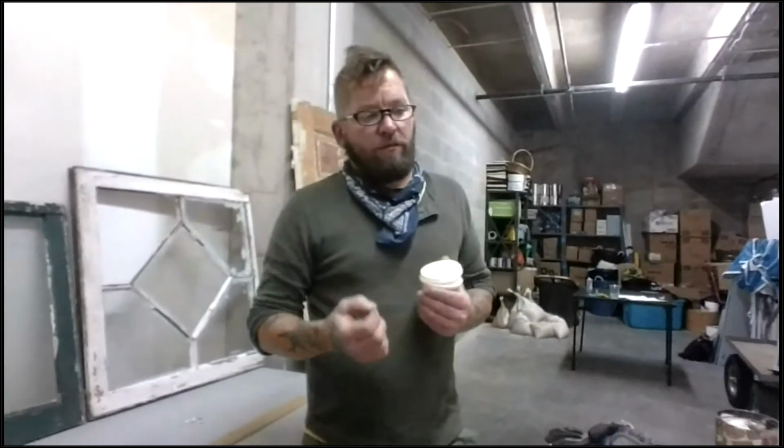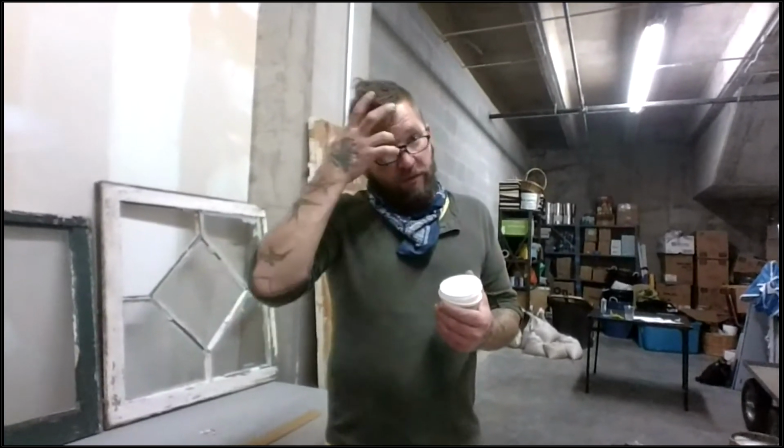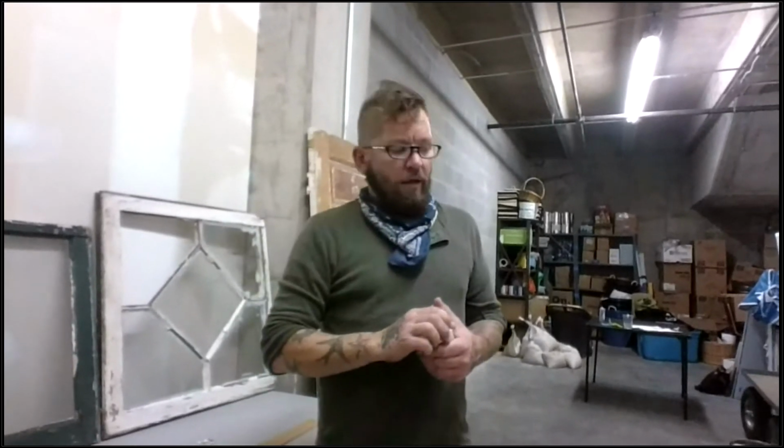Right. There's certain types of silicone-based caulk that you can't paint. It creates a rubber seal, and a lot of those are used in kitchens and bathrooms and interior. But read your label too, because if you tried to paint it, the paint won't penetrate the silicone, and you'll be left with a bit of a mess. It will look like you just wiped oil on whatever you're painting. So be sure to read the label that it can be painted if you're going to paint it.